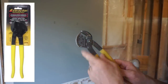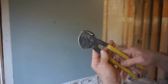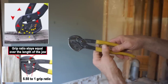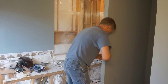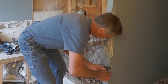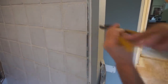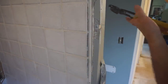Here's the tool — it's a pair of extractor nail pulling pliers. They're dedicated for pulling nails out of the back of a piece of trim, but the reason it works so well on corner bead is that once you grip it and start pulling, the leverage of pulling is forced through this curve into the jaws, so the harder you pull the harder it grips — which is a remarkable design. This pinch and grab and turn pulls it right off. I just kind of jam it on the corner and it grabs that corner bead, and if it doesn't tear it off it tears it apart.